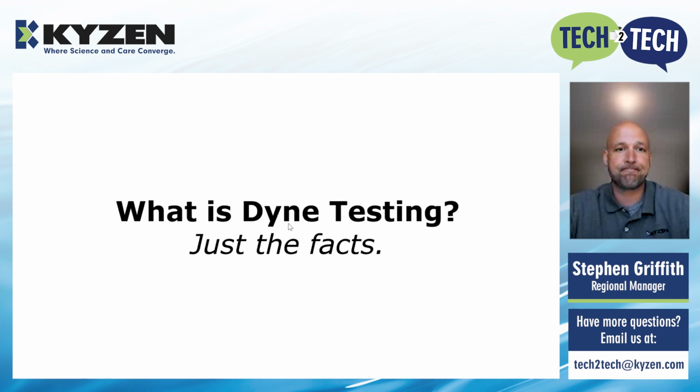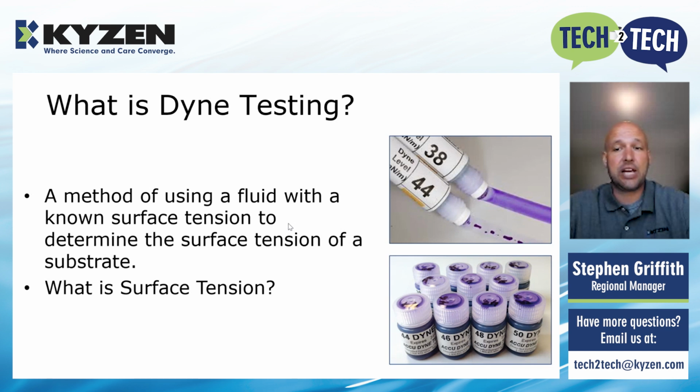So we'll break it down into some simple terms so that everyone walks away with a pretty clear understanding of what Dyne testing is. So the big question, what is Dyne testing? Well, Dyne testing is a way to measure the surface energy or the surface tension of a material using a liquid that has a known surface tension to it. And so why does knowing the surface energy of your part matter? Well, if we want to paint or glue two pieces together, or you want a coating to stick properly, then the surface needs to have the right amount of surface energy for that to happen. So a Dyne test is a quick way for us to confirm that the surface is prepared enough for you to have a successful bond.